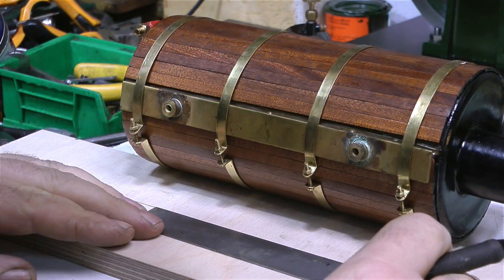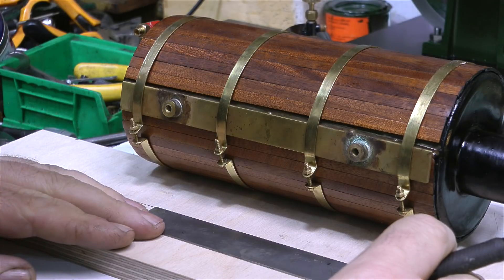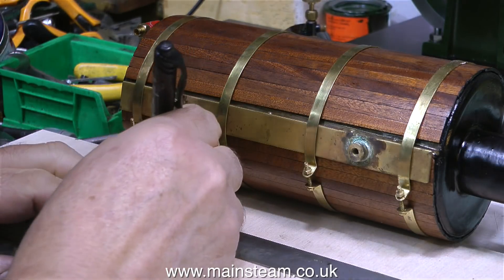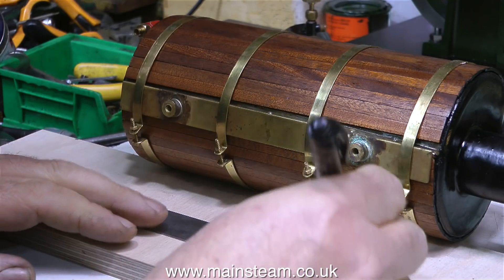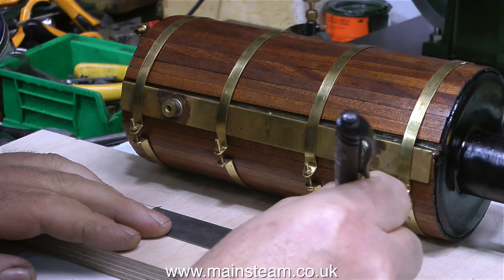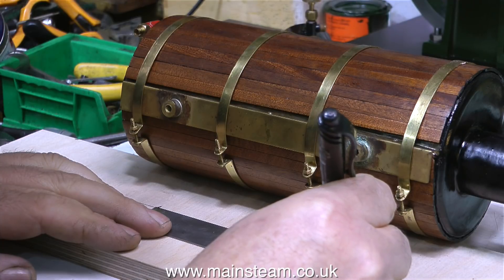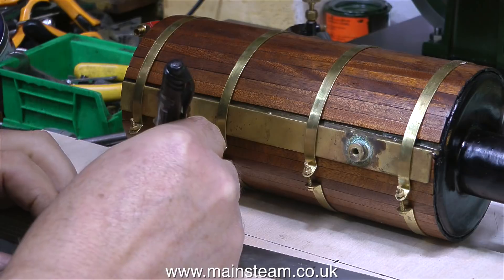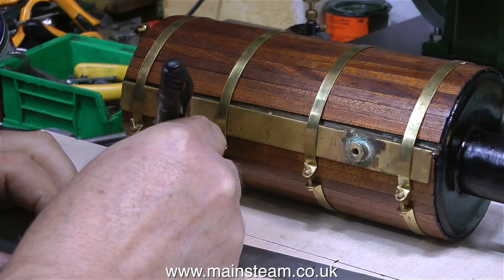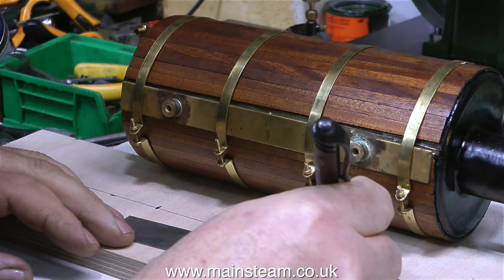The bottom of this boiler looks a little bit odd because it has a silver-soldered plate to cover the seam — it's made from a piece of rolled flat copper, not a piece of tube. The brass strip with the two threaded bosses silver-soldered to it is mounted to the boiler using the boiler bands and it seems to be okay. When I first bought this boiler it needed a hydraulic test, so I did a video about that. Here's an excerpt from it.